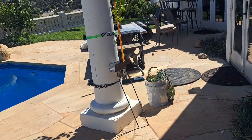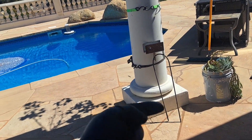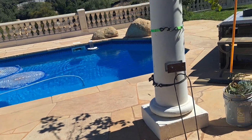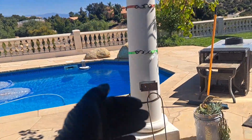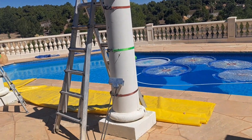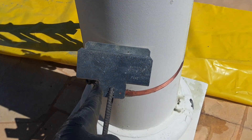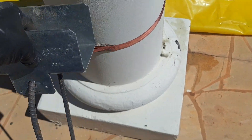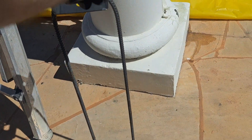I just put the last couple pieces of rebar in there. Took the rebar, put a little 90-degree bend on them, hung it down there and hooked it to the bracket that was left over, set in the concrete. Brought it up to the top, cut it. But then the other one I looped over the top and set it back down. So each of them have three bars of rebar. And then for this middle bracket, two 4x8s have to land on here. See this right here — did that big rebar loop. This thing will be embedded, with like three feet of rebar extending down in.